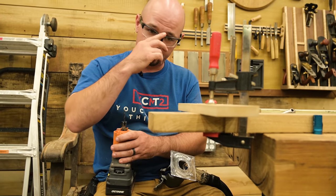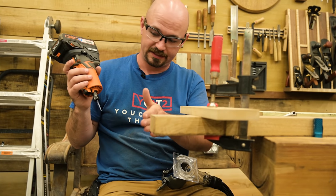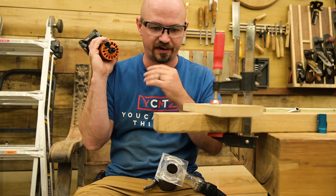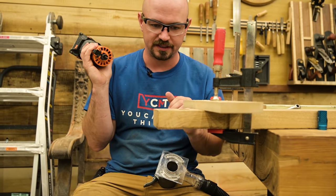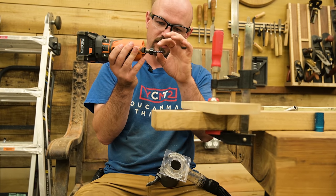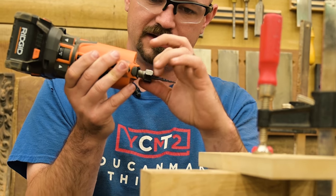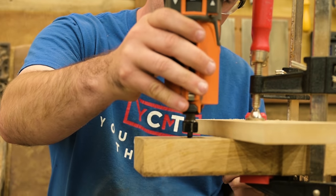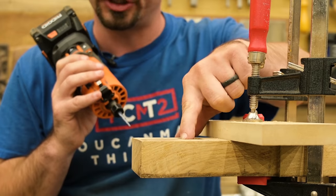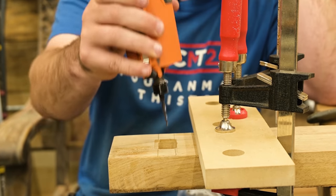There's going to be a wedge that goes in here to tighten everything and pull it all together. So this needs to have an angled slope. So I'm going to use a tapered bit to do that. I was trying to figure out the right way to approach it. I never tried this technique before, but the entire bit doesn't cut. It does have a smooth shank. So what I'm doing is lowering this bit enough that the part that doesn't cut is sticking out below the nut, and I'll run that smooth part in this little shelf that I just made as a guide, kind of like a bearing, and that'll hopefully keep me straight.